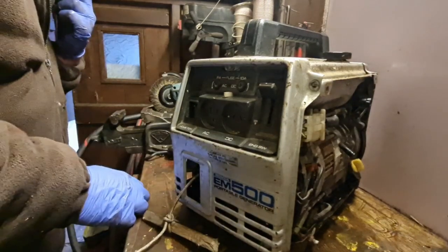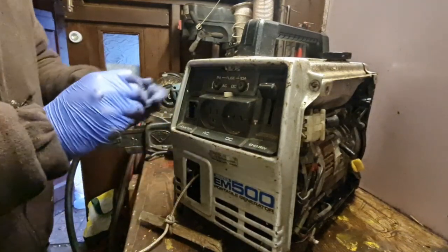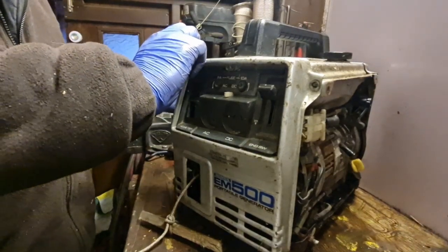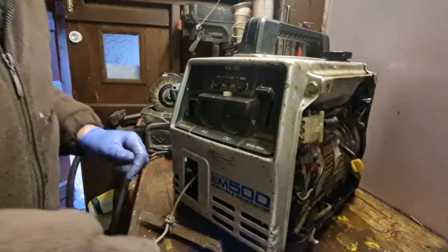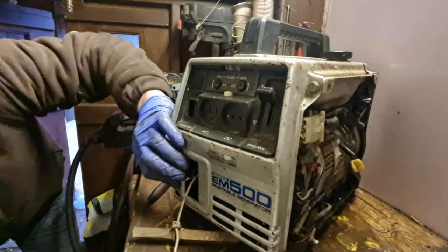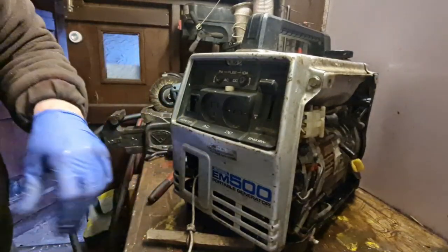That petrol drip, I'm not majorly concerned about that at the minute, because I've had this before and the next morning they've dried themselves up. You can never tell. It might just be because everything's dry, that it just needs to swell up a little. So we're not too worried about that little petrol drip at the minute. Yeah, we'll leave the side covers off while we give her a test start. We'll just leave them off and see what happens. I can't see this is going to run, if I'm honest.